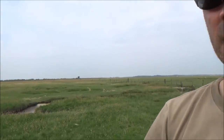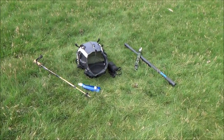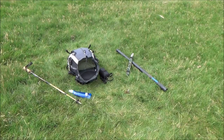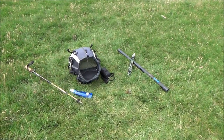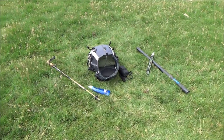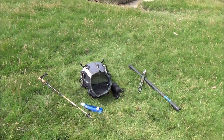Right, that's me all packed up now, the station's all packed away more or less. Poles down. It is heavier than the 6 metre pole, but to be honest, carrying all the kit I had today - all the radio bag, water, camera, extra shirt, the basher and the shelter kit - and compared to what I was carrying the other day, it was nothing. So the difference in weight from the 6 metre to the 10 metre pole isn't really an issue. I'm really pleased with that. I was impressed with the SWR that came down to 1.5, 1.6, which Jason thinks is acceptable, so that's alright - it could come down a little bit more but I'm more than happy.